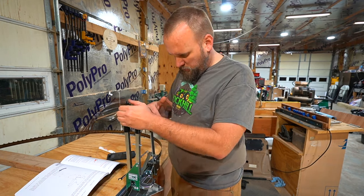There's also a tension clamp here. If you get this too loose, then when it pushes forward, if there's any binding, it'll actually slide back. I had this too loose the first time I turned it on, and I was seeing it kind of bounce back. So I tensioned this up until it quit, and then just went a little bit more. You can hear it struggle there to push.